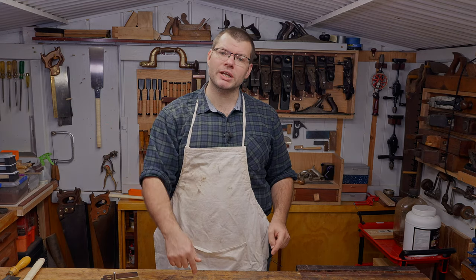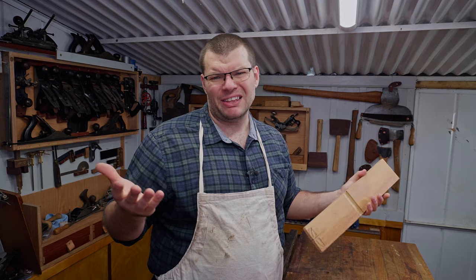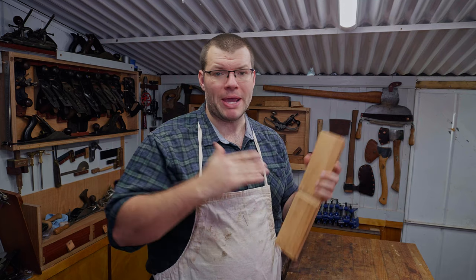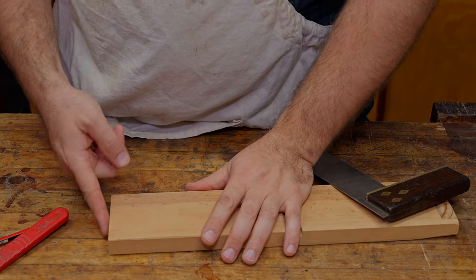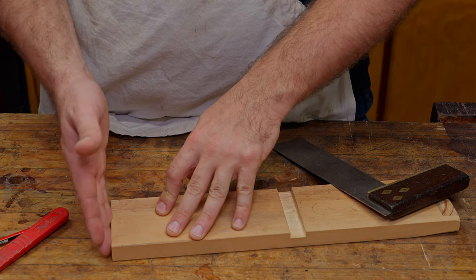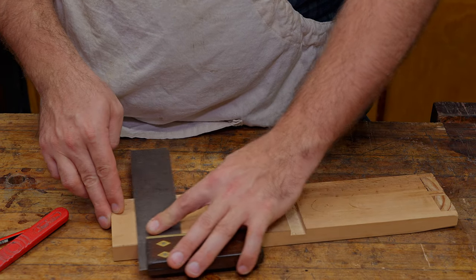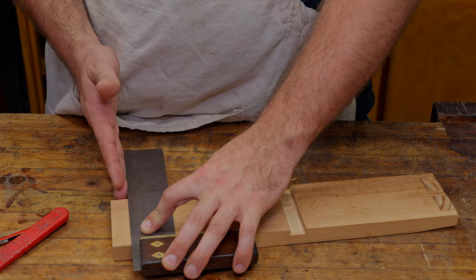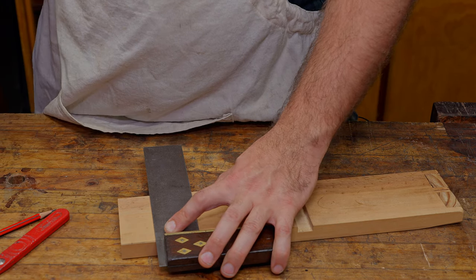Now that we've got that out of the way, let me bring you in here and we'll get started with our layout. For today's video I'm going to be working on the end — putting a rebate on the end of a board. This is a very common joint you would do if you're making a box, or aligning cabinets or any sort of carcass. If you're not sure about how square the end of your board is, I'd recommend you square an edge and then get it square on your shooting board. I have squared this off and I would reference on here to get how wide I want this rebate to be. I'm going to mark this part using that.